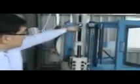Now another thing, we adjust our auto tool backing off device. This is a mechanical auto tool backing off device. The auto tool backing off device uses a mechanical design. They have a push inside. So use the friction power to let the lever go up and down to make the tool back off. But because there is friction, sometimes you must adjust the pushing, like you adjust the gibs. So you loosen the push, then tighten. Because now there is friction, then you tighten here. Therefore, you can see the lever work.